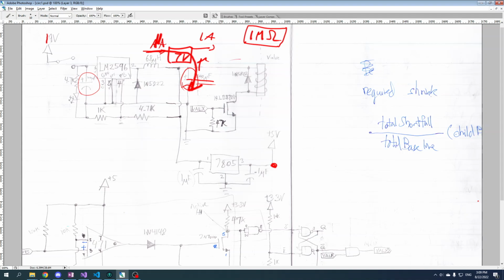So when your load fluctuates in how much current it's drawing, this capacitor will be able to pick up the slack in both directions, right? If it suddenly says it wants more current, well, this inductor isn't able to do that immediately, but this capacitor can supply electrons to meet that demand until the inductor spins up to that amount or whatever. So these capacitors, they're buffers basically. They smooth things out very nicely, and can also have a protective effect.